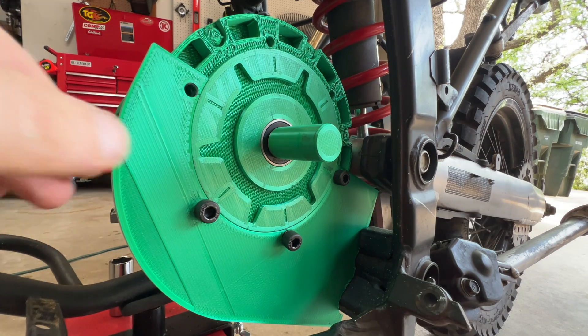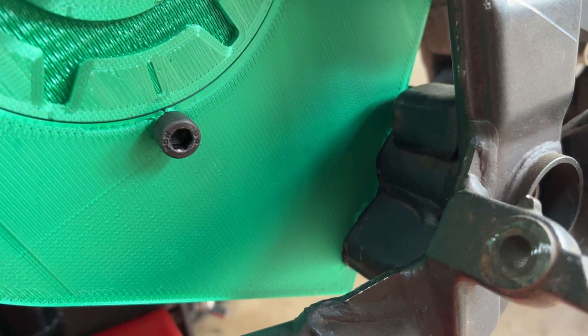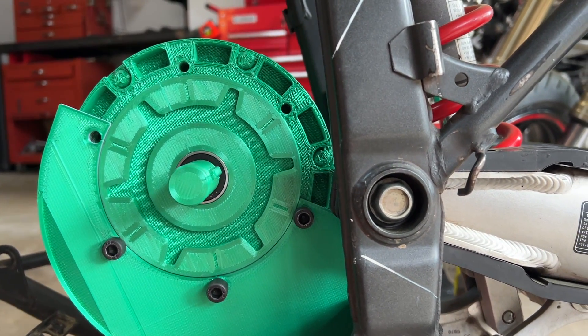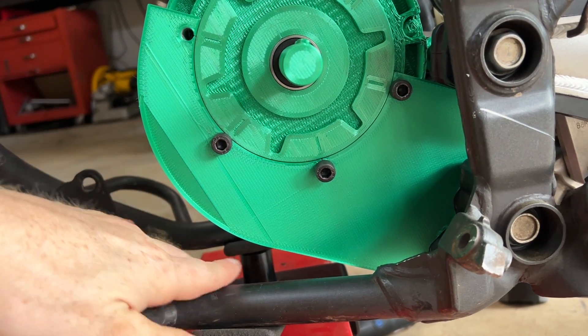After about 10 minutes it's looking pretty good, though it probably has to be a little lower. I made a couple more passes with the Dremel on low, coming at it from the other side, and got a pretty nice contour. There's a little bit of space here and there, but if this were a metal piece I'd have no trouble filling those gaps with a weld. For the most part this should be good enough to use as a cutout, and I think the motor position is good. I'll really have to test it with a chain and some load, but for now I want to use this cutout and attach to this mount point as well.